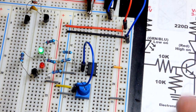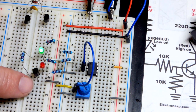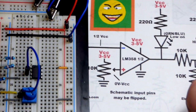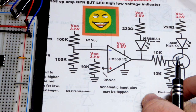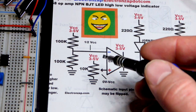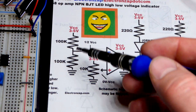The pull-down resistor helps hold the voltage down and also helps prevent false triggering — I can touch it and my body gives it a little signal, but the red LED only glows slightly. That's basically it — we wired it up. Looking at the schematic notes, you can also make an inverting comparator instead of non-inverting if you prefer, by swapping whether the signal goes to the inverting or non-inverting input.